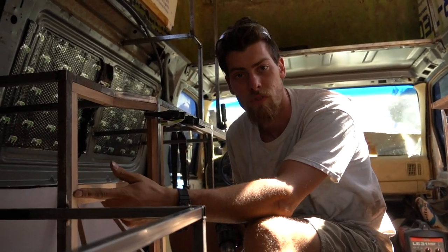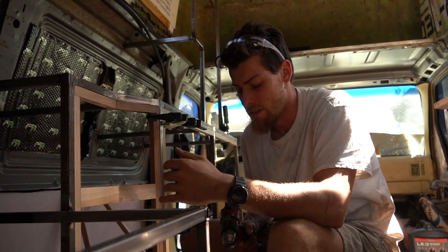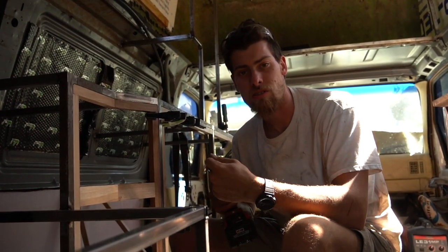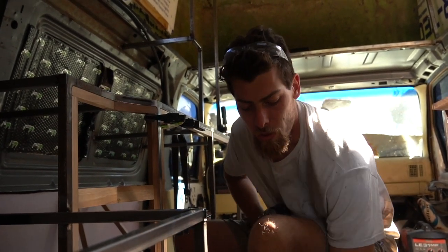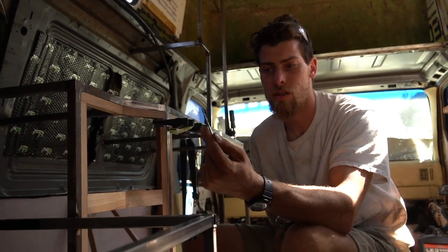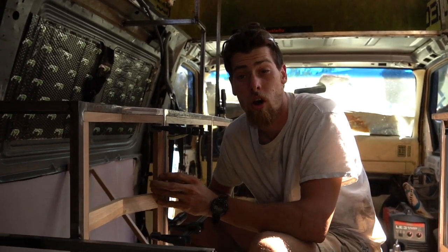That's what this is called — facing — as far as I'm aware. How we're attaching this to metal is I go ahead and take a bigger drill bit as a countersink, drill in about a quarter inch, and then follow it through with an eighth inch drill bit. We're working with hickory here, which is awesome wood.